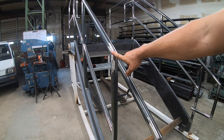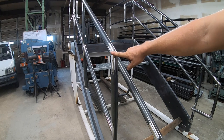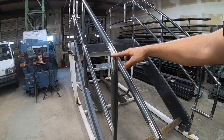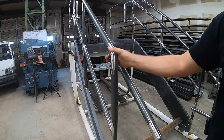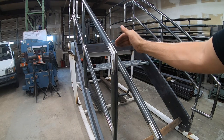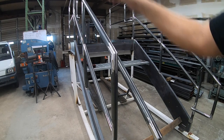Your second angle is the top of the bottom post. Here's a simple rule: this top angle and this bottom angle will always equal 90 degrees. If your step angle is 33 and a half, that automatically makes the complementary angle 56 and a half. You've got two pieces making up that angle, so divide 56 and a half by two — that's 28 and a quarter. So when we cut this piece it had a 28 and a quarter on one end and a 16 and three quarters on the other end — that gives you your top rail.